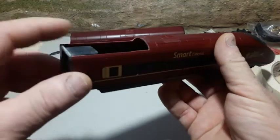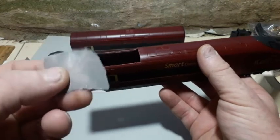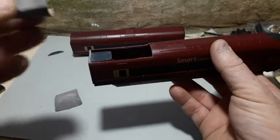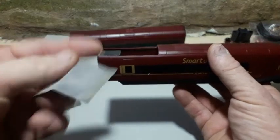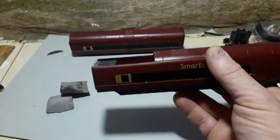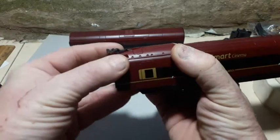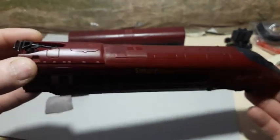This has now been prepared and I'm using wet and dry for this - from 600, 800, and 1000 grit. That's the 1000, just to take off any slight imperfections. The 1000 is also good for taking out any small surface scratches. This has taken a while to get to actually fit perfectly on there, but it does now and I'm very happy with that.